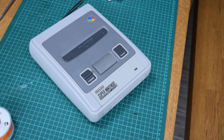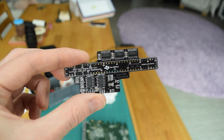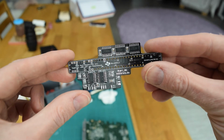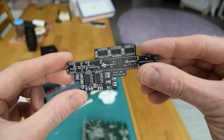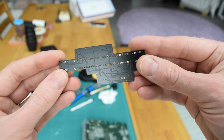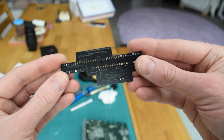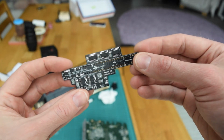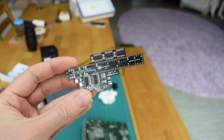Now that it's cosmetically pleasing, I wanted to look at what was out there as far as mod chips go. The most appropriate one for this console is the Super CIC UIGR chip. This lets you do a few cool things. You can play games from any region, you can run PAL EU games in full screen, more on that later. You can reset the game and adjust other settings from the controller. The most interesting of these to me is the full screen thing, and I just wanted an excuse to open it up and get the soldering iron out really.